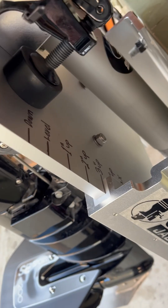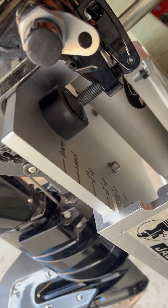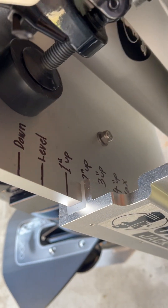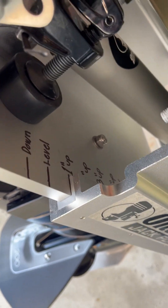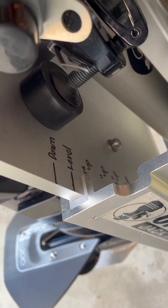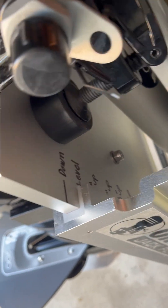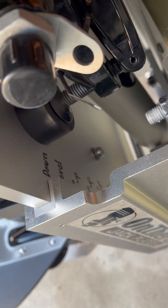Got it maxed out. When I was installing the hydrofoil it made it much easier. When I drive I always have it all the way down. I did make some markings here so I know how far my cavitation plate is past the hull — the bottom of the hull, which is right here. Right now it's level. We are going all the way down.